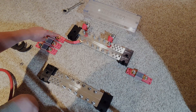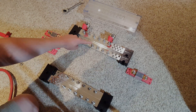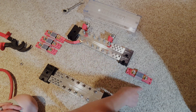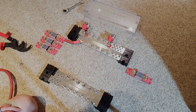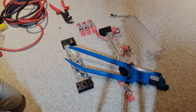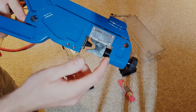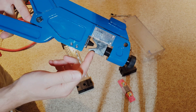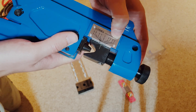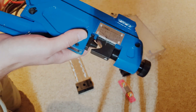The plan for wiring these up is to have the first stud run as shown, the second one run to the second stud, the third to the third stud, and the same thing on this side. To make all my crimp connections I'm using this die-less crimper. There's a threaded backstop, and the larger the wire diameter, the further this moves out. It has settings from number 8 wire all the way out to 4-0 wire, so you just line these up and you're good to go.